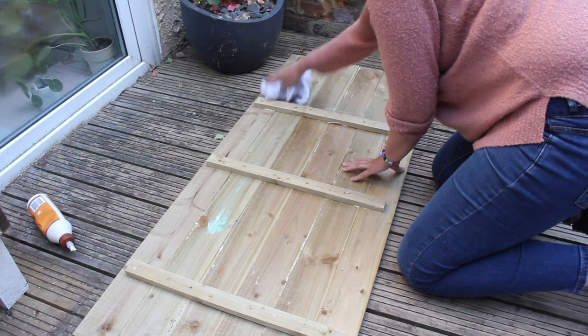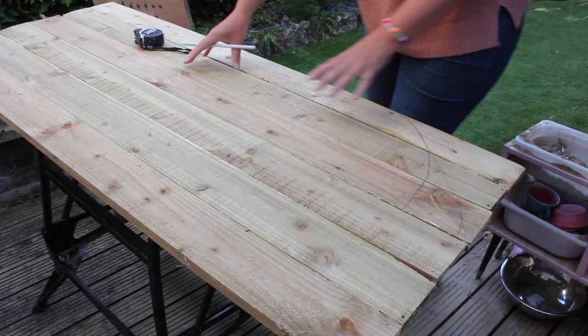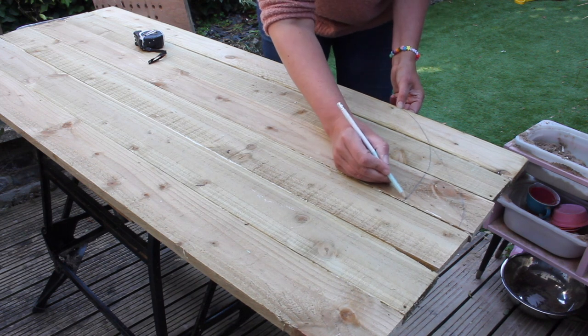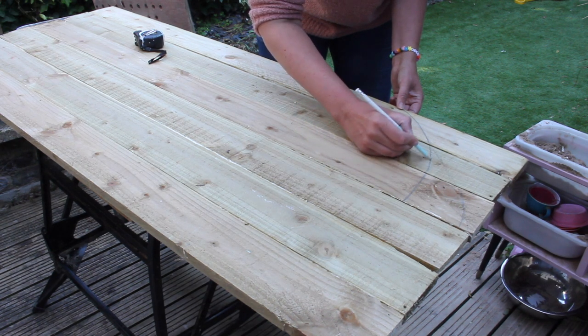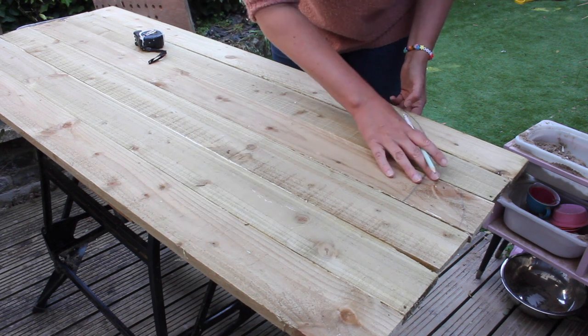And then we can flip our table top over. There you go — table top! So at the beginning I wasn't knowing whether I was going to make a rectangular table or a circular one. I was thinking circular first because Kiki plays on the deck a lot, and when there's no corners she can't hurt herself when she falls over or walks into the table. But I also think circular takes up quite a lot of space on my small deck. So what I'm going to do — I'm going to keep one end straight but the other end is going to have a nice semi-circle. Best of both worlds! I want my table to be roughly 120 centimeters, so at 110 centimeters I made a mark, also marked the middle of the table, and I'm just going to draw a soft curve to go from this mark to that mark. If you're very precise you can do this with a template — I'm just going to hand draw it. I'm going to cut this out and then put this bit of timber on the other side, mark it, and then that side is perfectly the same size as this side, hopefully.